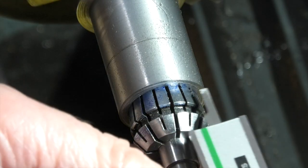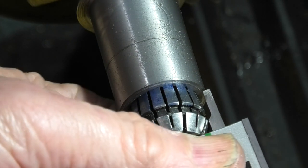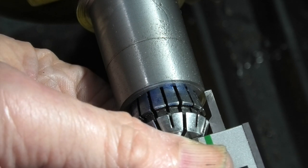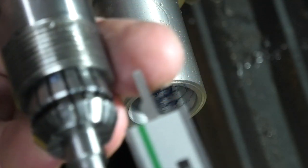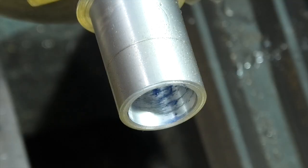You can see lines across in the bore so I think that's the right angle. The next thing to do is check the depth — there's a depth gauge on the end. It's 14.79, and comparing that with one I've been using which is 14.9 — it's not that far off. What I'll try and do is just get a better finish in the bore.